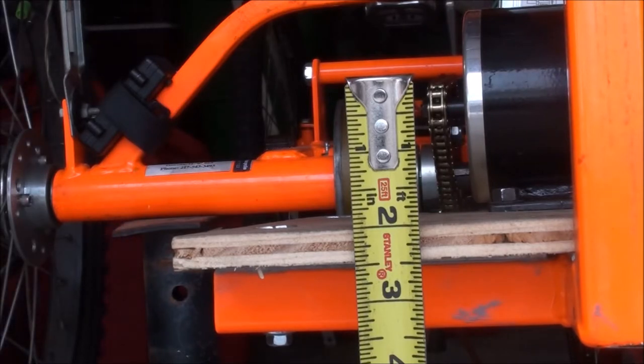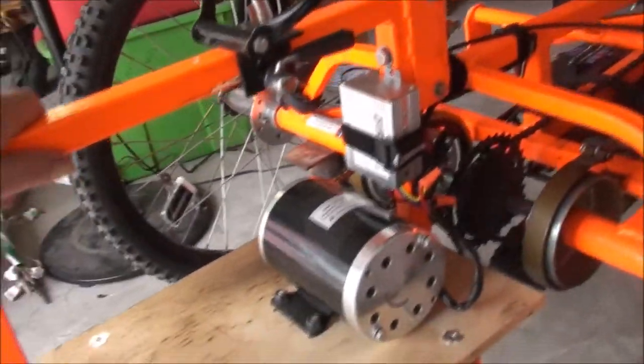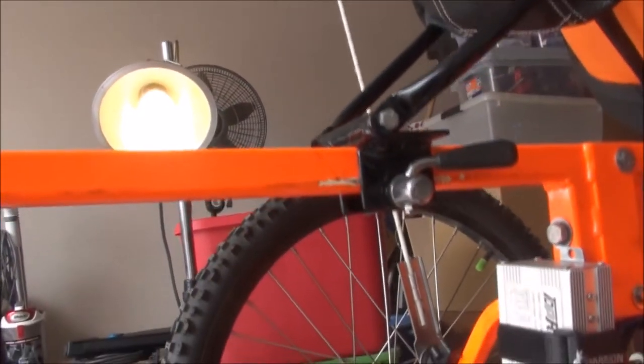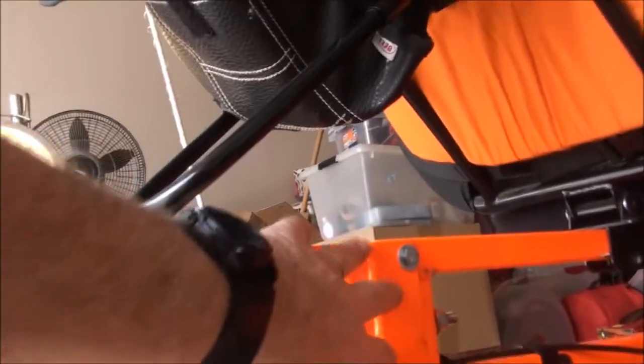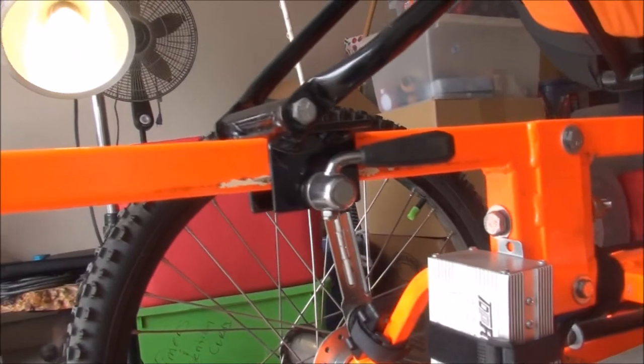You can ride it in that condition, but we're going to fix that. The problem is: when this bike was made, this piece right here mounts up here and it's the only place that mounts. I put a big bolt through it to help stabilize it, but it didn't fully work — it's probably less bad with the bolt. The issue is this was really just made for a basket to carry stuff; it wasn't intended as a motor mount. Because there's only one mounting point, it's flexing downward.